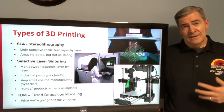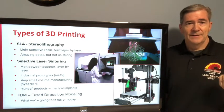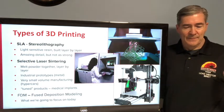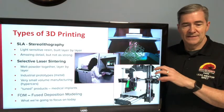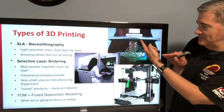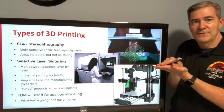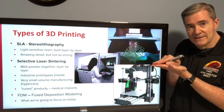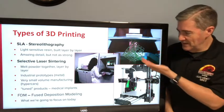There are a bunch of different types of 3D printing using additive processes. There's SLA, short for stereolithography, where they use a light-sensitive resin and expose light to it layer by layer and build it up. The plate dips into a thin layer of that resin, the light exposes the resin and hardens it in certain places, and then the plate goes up a little bit and keeps going up, exposing more layers. So you can build an object something like this.